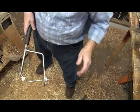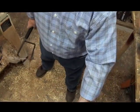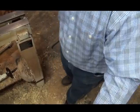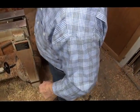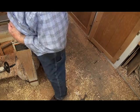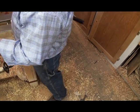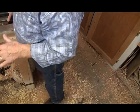On a bigger piece, I have an adjustable or sliding headstock on my 1642 Jet, which I really like. When I'm on a big piece, I even want to have my body up against the end of the lathe. I can adjust the headstock to the length that I want so I don't have to bend way over or stand back. I want to be as comfortable as I can get so the tool can be set up the best it can to do its job. The name of the game is confidence, confidence, confidence. Follow what the tool wants you to do and you'll do good.